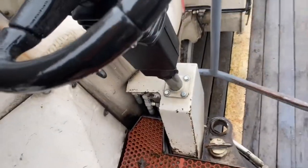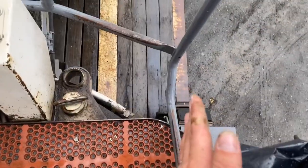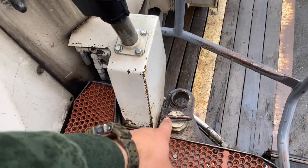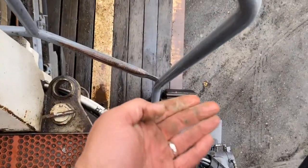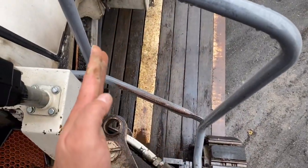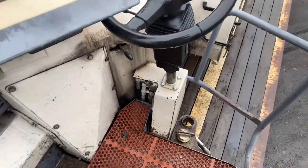Another little thing you can do with this machine — this controls the swing on this track, so I'll move this back and forth with one hand, pull that pin up, and then what I'll do is I'll set this thing down on some gravel or a piece of roadway that I want to grind up, pick this track all the way up, and use this lever — it'll swing this track in to right here. I'll re-pin it, and then I can grind around a corner and get real close to obstacles.